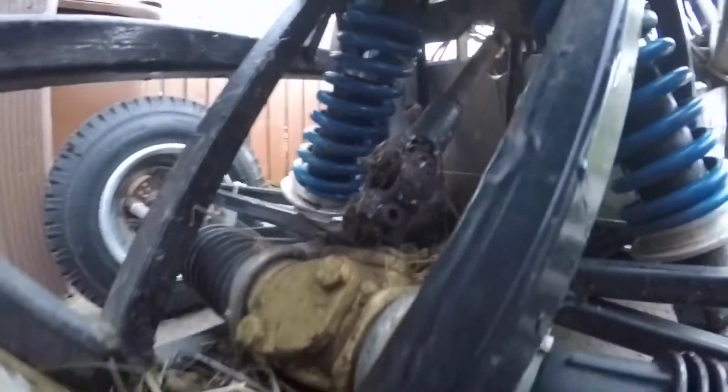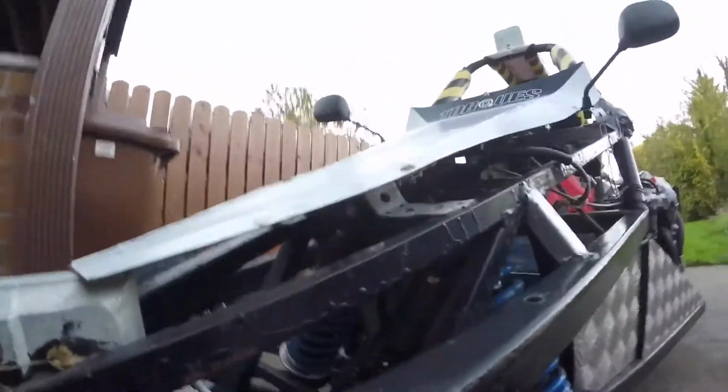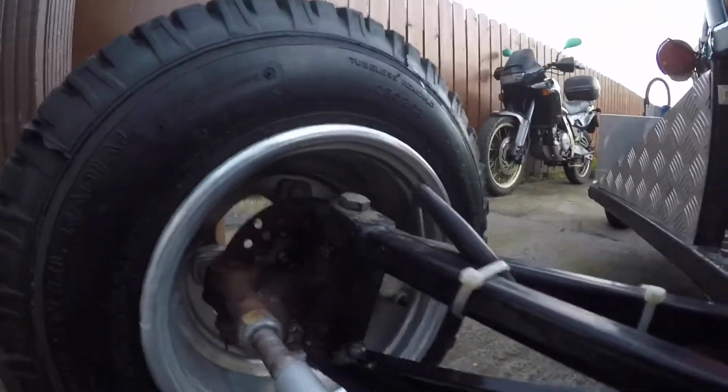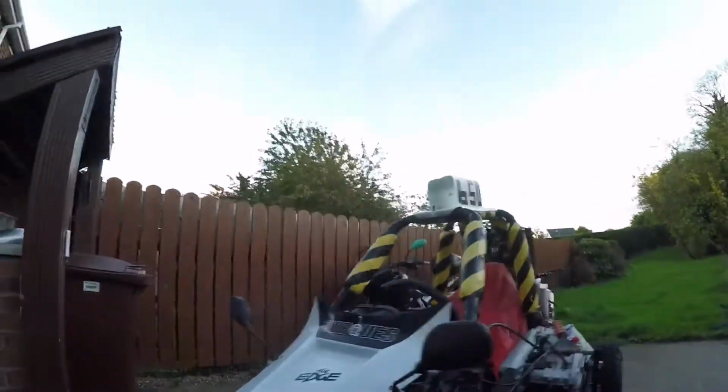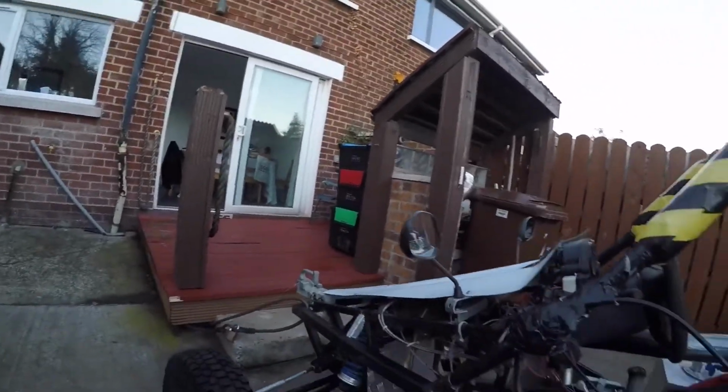The steering is a Ford Escort Mark II steering rack. You cut off the big long side you don't need, cut the rack and weld it back on and just make a wee tiny rack, and it's a plastic wee bush you need machined. That one is actually from a rally car, which is a higher ratio, and obviously here's the ball joints and stuff. Half a turn of the steering and it'll be full lock of the wheels. Great fun to drive.